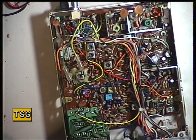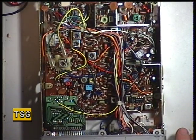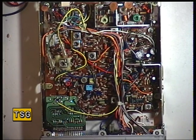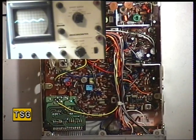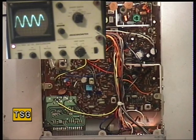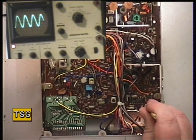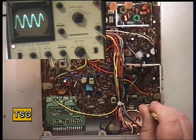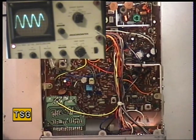Now I'm going back to a 100 microvolt signal to replicate S9, and that's how we're going to set the FM detector. I'm going to adjust transformer 12 for maximum recovered audio. And look — we've gained some there. If that wasn't set spot on, it becomes distorted to receive. So we have gained some — that's brilliant.